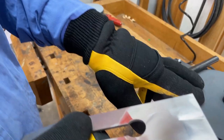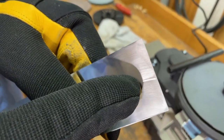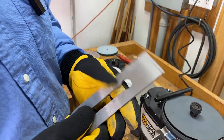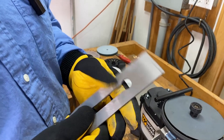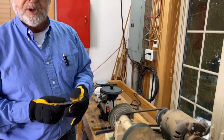I've taken things as far as I can with this machine and it's pretty shiny — there are a few areas that didn't quite polish up, which is not unusual, but we're close enough to move on. The next stage involves buffing. This is the last step for lapping the back of the plane iron, and it's the same process we'll use in the next step for honing the bevel. We're going to use this buffing wheel to finish off step one.